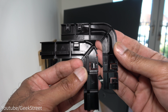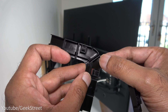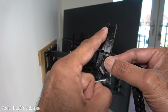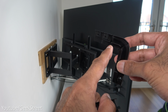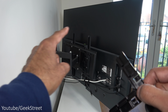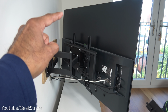There's 2 different types of corner adapters. So this one has A on there, this one has B. Now the A ones use as a starting point and the end point. So as I'm starting from that corner, I can have 1 LED going through that point, another one going through that one. Now, as I'm going up, if I need to curve around, that's when this comes into action. So that'll be at the top there, and this one at the bottom. And then another A piece would go at the other end, and that's where you'd stop. So one strip would be going like that, and then the next one would be going from there up, and then the LEDs can be cut.